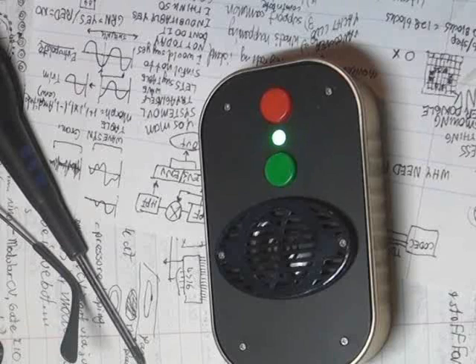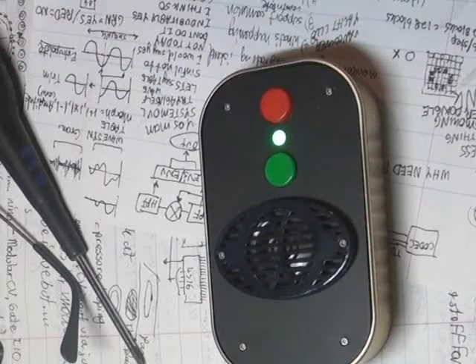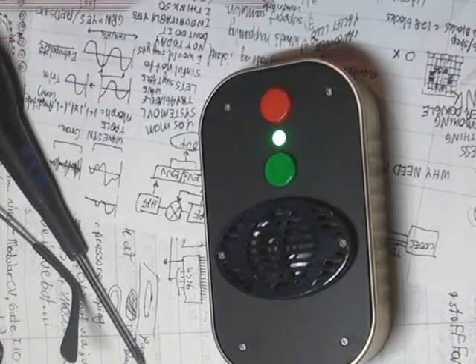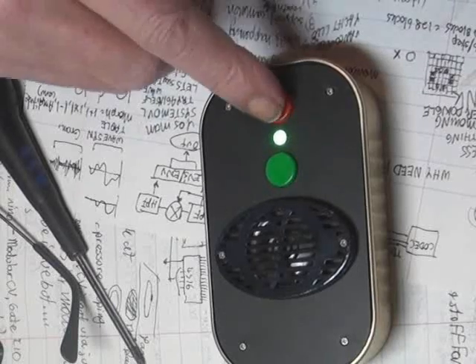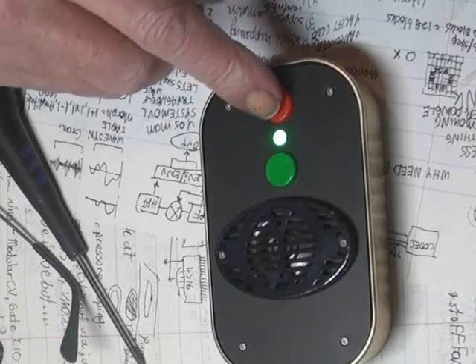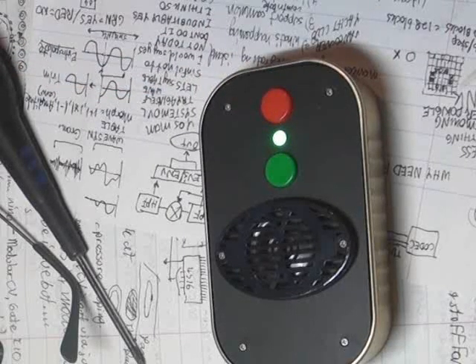There's also a randomization of the sample rate — plus or minus 3% — I don't know if you noticed. The RGB LED shows green if the answer leans toward yes, red if no, and yellow if maybe, with blue flashing in sync with the audio. There's also stop-repeats for one level, so the same message doesn't play twice in a row.